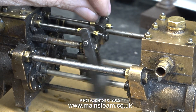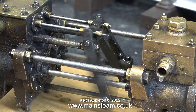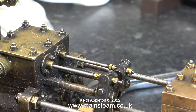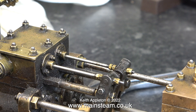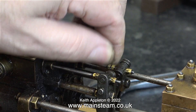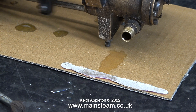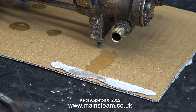Rhythmically, this engine is not right — it's just not evenly balanced. To alter the valve timing, I will need to release the four locking nuts. To be honest, I was puzzled as to why the settings of each valve are so radically different. Look how much of the valve rod sticks out of the nuts in the foreground. Setting the valve timing on one of these pumps is a bit of trial and error. Don't forget the water cylinders — the water that goes through them is what lubricates the piston, but now there isn't any water so I'm pumping some oil in there.